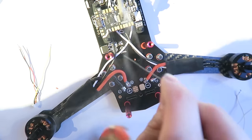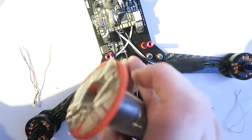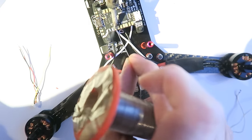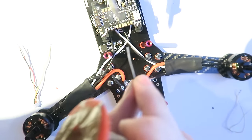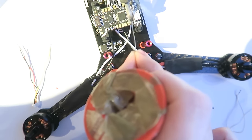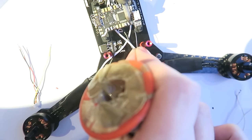Now you're only going to be able to get the voltage of your battery if you have connected the flight controller's power direct to your battery's solder pads, because this flight controller has a built-in 5-volt regulator, so you can plug in a 4-cell direct into the flight controller. And so it's useful to use that telemetry port to tell you your battery voltage. If you're not using an OSD, it sends it to the Taranis.